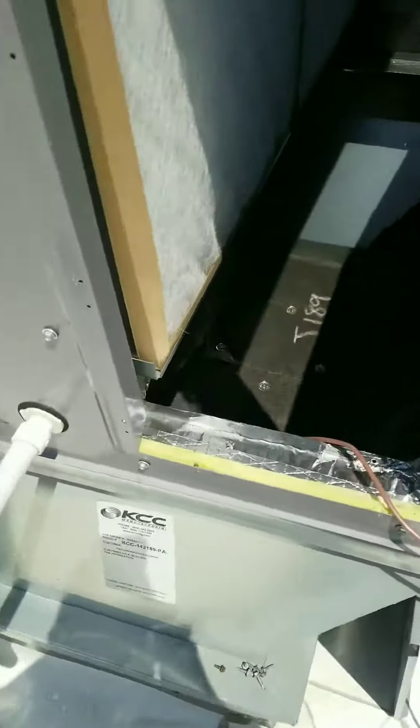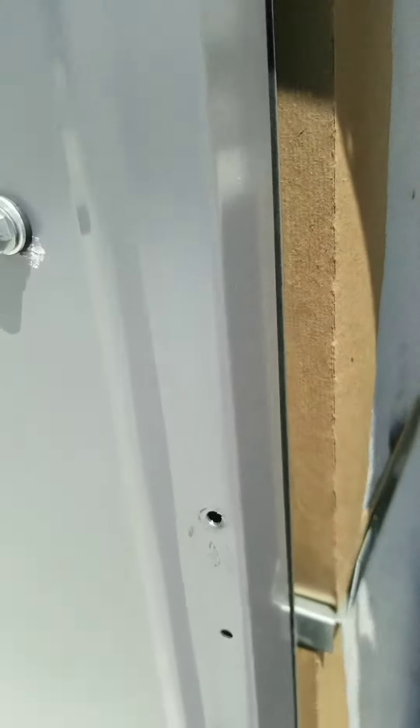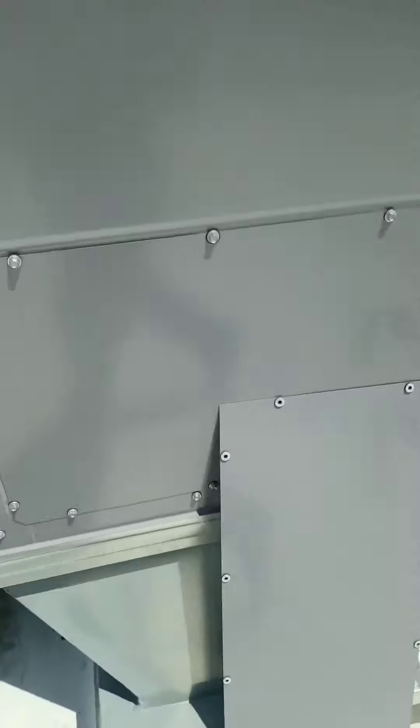Got my wire pulled up — there's a grommet through the duct, we're going to return there now. Found the wire nutted twice inside the supply duct, so we're going to go ahead and run our new wire through. We'll wire tie and secure everything when we're done to make sure nothing shorts out again.